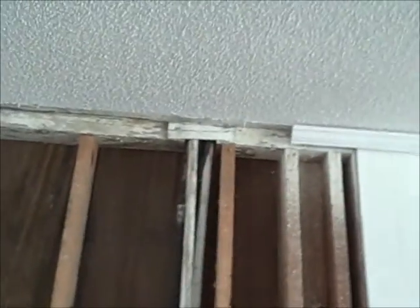I'm going to look on the other side and see what that board looks like from the back — it looks pretty bad. We've got this piece tore out. What happened here was that the attic was sweating so hard because it didn't have any power ventilators in it, which we're installing two of. When it gets so hot up there and so cool down here, these pipes sweat, and that's what was buckling out this stuff. The return air is right here, which draws a lot of cool air up that wall, and then you've got that heating unit up top with the heat and everything — the back wall here is completely fried.